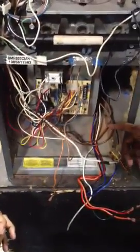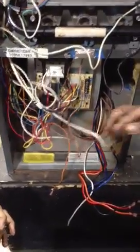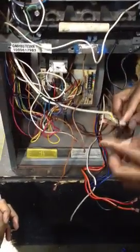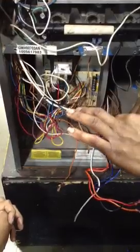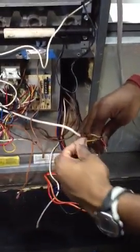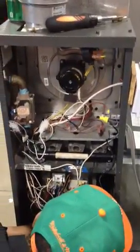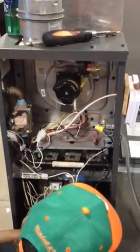Now that we have the pin connection back in and 24 volts into our board, the thermostat wires come in here — it's typical thermostat wiring. We'll hook up these four wires: red for hot, green for fan, white for heat, and yellow for air conditioning. You just plug those right into their terminals — it's color coordinated on the board so you can't go to the wrong spot, as long as you're using the right thermostat wire.